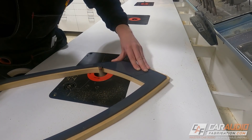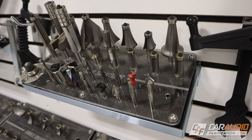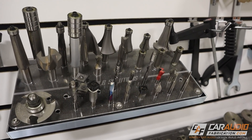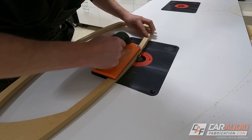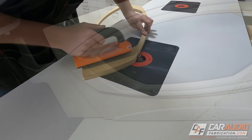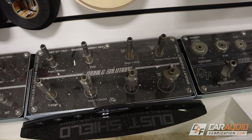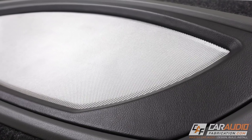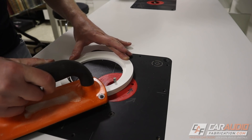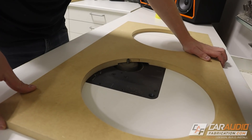I think this is a big mistake because the router is a very versatile tool. With the router, we have all these different bits that we can use for different tasks throughout a build. Flush trim bits allow me to copy a profile like these Mobile Solutions templates. We can use different profiling bits like round overs and chamfers in order to add depth and dimension to a piece. We can use rabbeting bits to cut grooves in material so we have perfect gaps for upholstery materials between different pieces. Really there are a ton of different applications — custom speaker adapters, parts for subwoofer boxes, amplifier racks, etc.